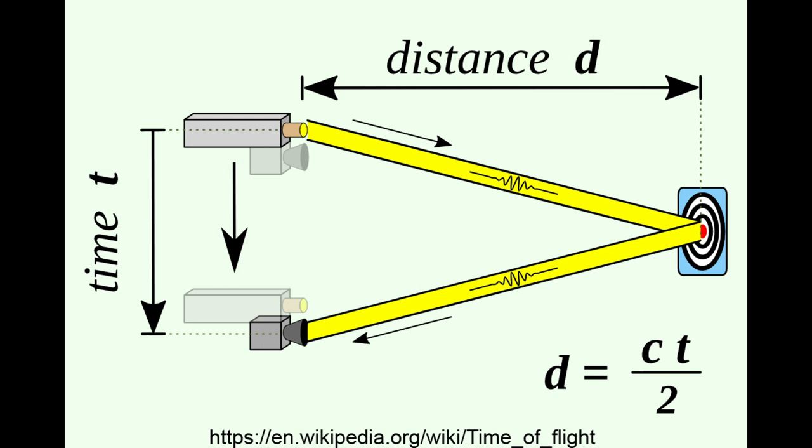Light moves fast. Light moves as fast as light. So you do need to have a driver. You can't just turn this on and boom, you've got data coming out of it. You need to have that precise timing circuitry. There are other companies that sell the VCSEL drivers. You just Google for VCSEL driver and you can check it out. Various companies sell them that will drive the VCSEL that you've got here and then measure the light back.